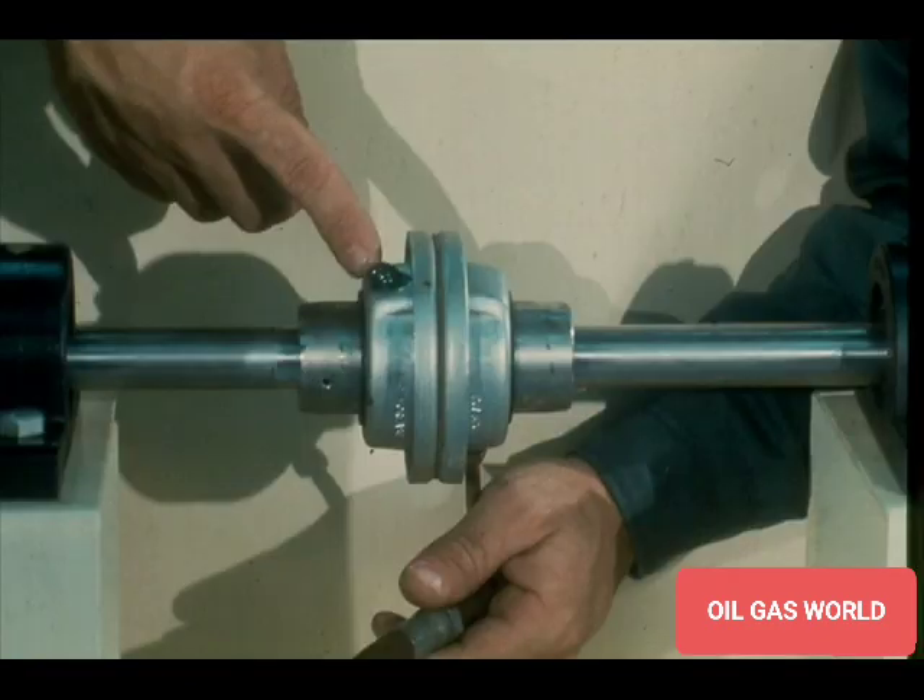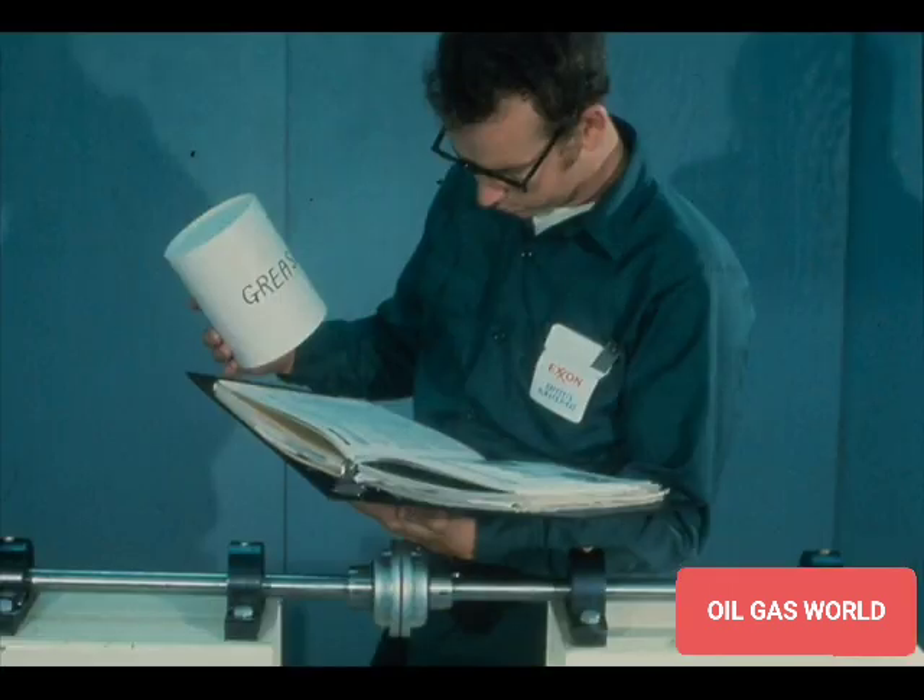You can imagine what would happen if grease was injected through the top half — grease would vent through the bottom hole before the coupling was full. Using the proper type of lubrication is very important. Always check the manufacturer's manual for the coupling and use only the lubrication indicated or a suitable equivalent as dictated by your plant.